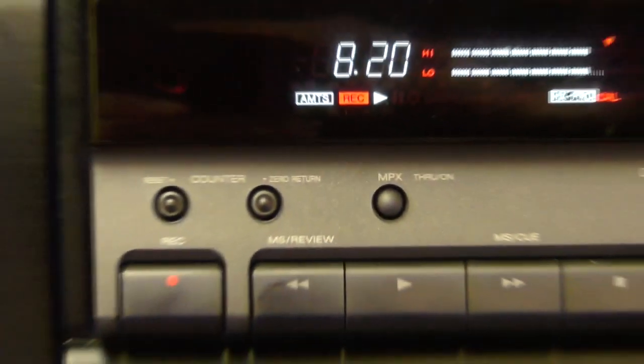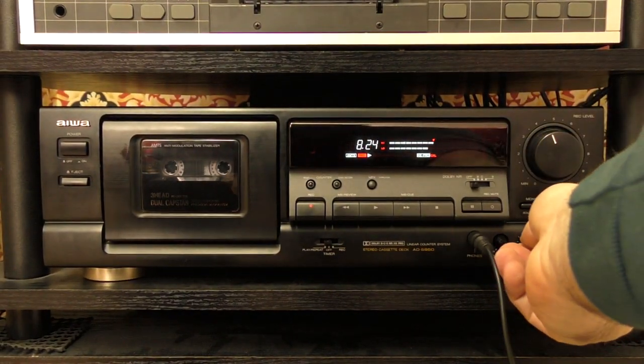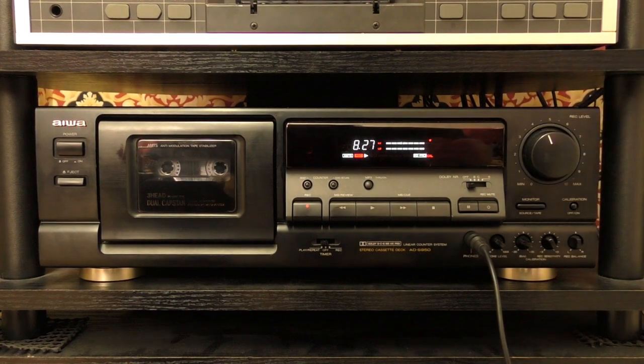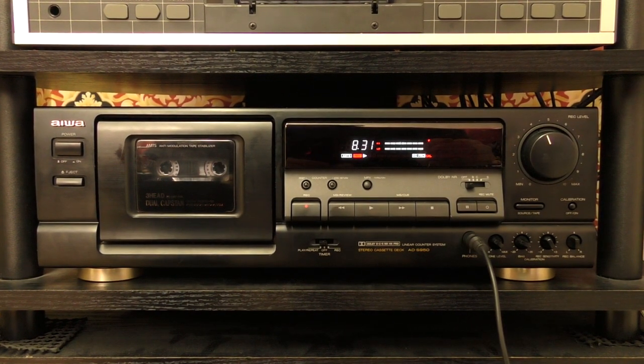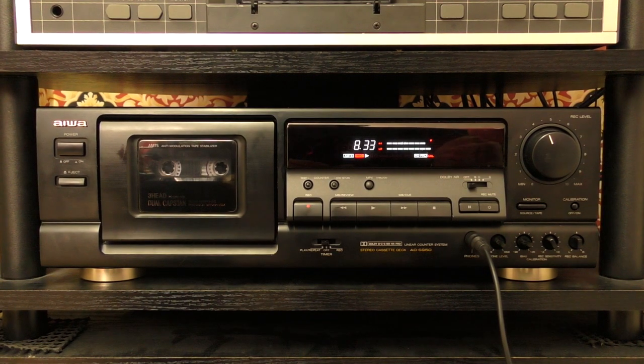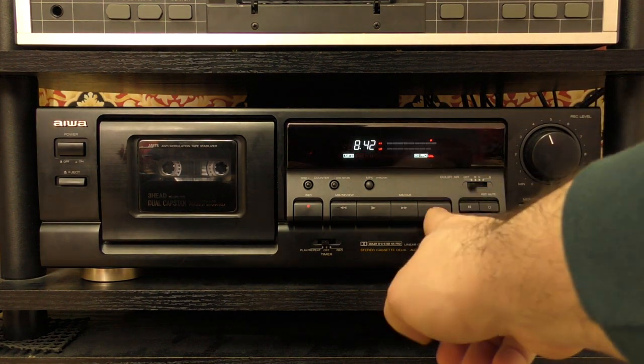Oops, let's get the zoom right. So, it's about there. I'm going to give it a little bit more negative bias, to be honest. Okay, so not looking good so far for the discerning audiophile. Maybe it's for the discerning audiophile, because the discerning audiophile will have a deck with calibration facilities that will be able to drop as much bias as you need to get this working.